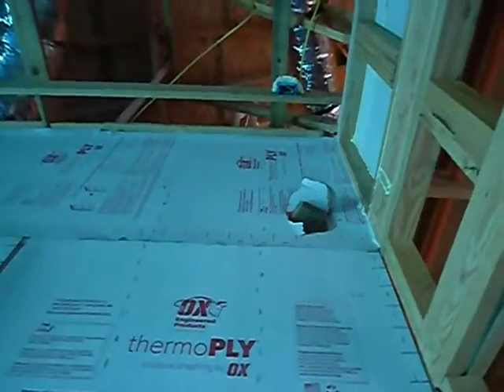Moving on along — you see this inside like this? This is for shear strength. It's not a drainage plane like on the exterior wall, it's not for exterior strength — it's for shear strength. Kind of like in the kitchen when I was showing you the straps with the nails, comparing those to the electric meter. These walls serve that purpose. Somebody up here had a pretty good idea, but somehow the platform just goes through the wall right there — that needs to be sealed up. Once it gets up here it's no longer shear strength, because that's the space between the living space and the attic.